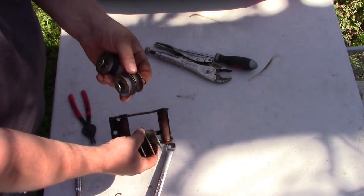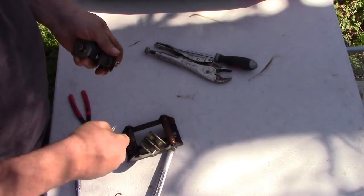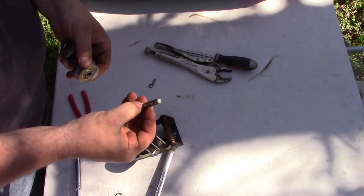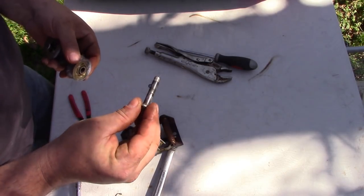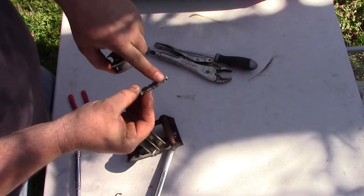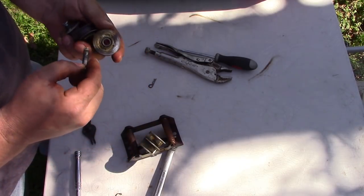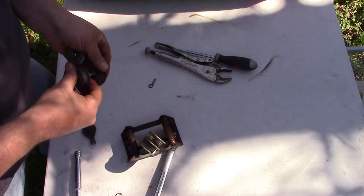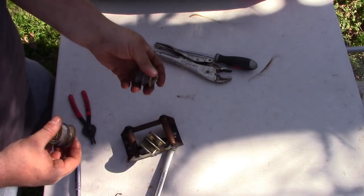We got that winch installed. Fortunately that wasn't as hard as I thought it'd be. I'm going to work on getting those pulleys cleaned up and lubed and then we'll get that wire rope reinstalled. These are the pulleys that came off. I'll take them into the shop — I'm going to sand the burrs off the pins, put some lithium grease on there, and do the same thing with the other pulleys.